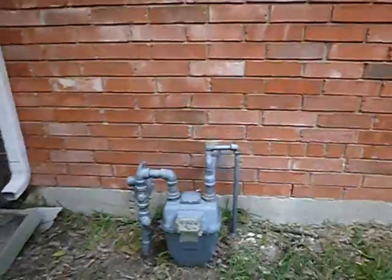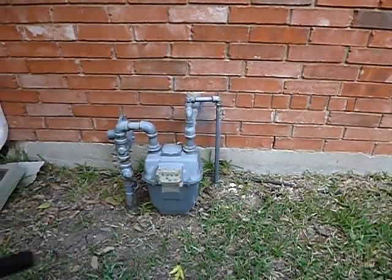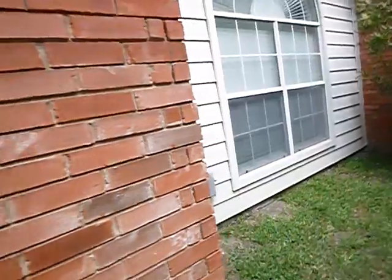This is your gas meter. These pots are not supposed to be closer to the ground than six inches, so the ground is too close to the bottom of this meter pot. Coming along — with all the siding and inserts it's probably not a big deal, but we haven't seen any expansion control joints either.